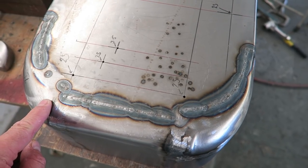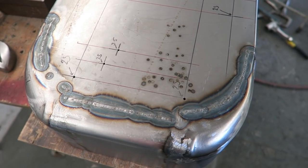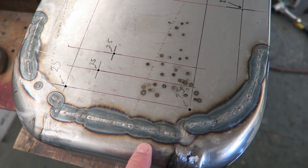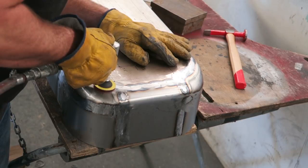possible. I'm also going to put the belt sander around the insides as well, just to take any tiny bead off. The more beads you get rid of, the more finesse you'll have, because you won't be folding the material around the bead.